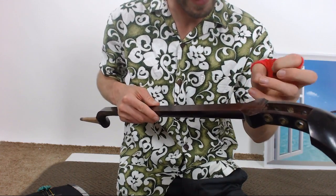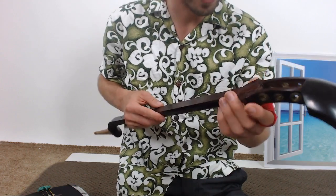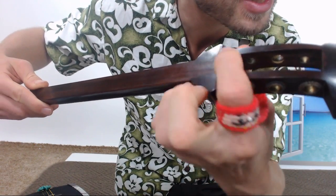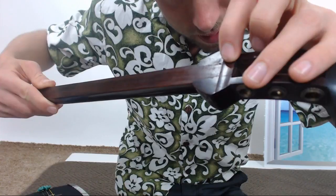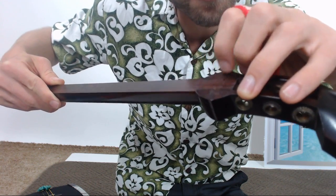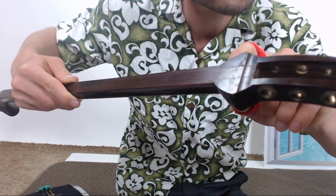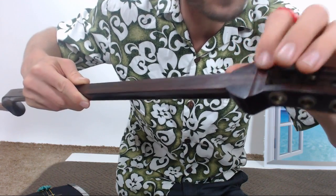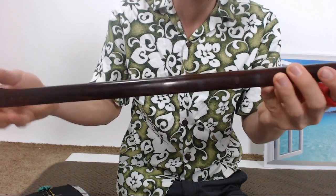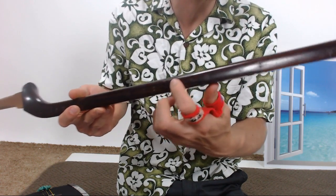Just soak it in water, let the hide glue dissolve a bit, scrape it away, use some acetone or such, and then Tite-Bond wood glue. You can see there's just the tiniest, like a quarter millimeter even, bump, because the saw sits in deeper than the tenon, but leveling it flat would mean removing the finish, and we don't want to do that. So that's fine. Going to use warm soapy water to remove the residue here.